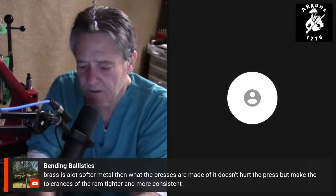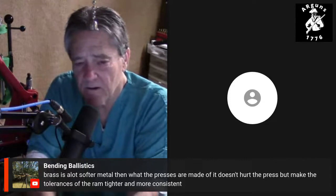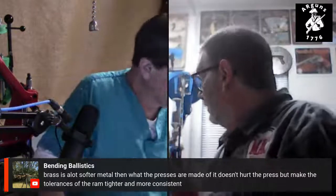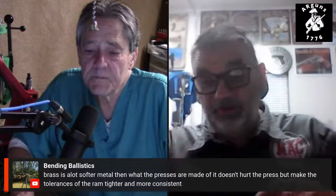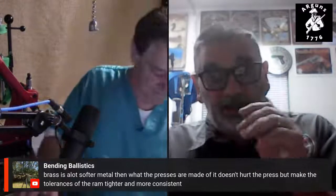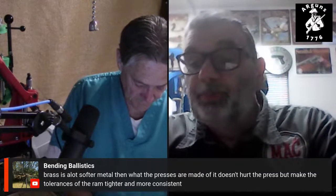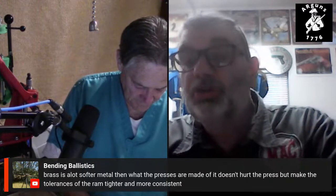What did you do, did just using the press smooth it out, or did you oil it or lube up the contacts on it? I lubed up all the actual shaft down the middle that turns the head. So I lubricated all that. And then I lubricated all the joints all the way down where you pull on the arm. And I put some oil and a little bit of light grease where the turret head turns and the detent ball and everything is. But I think the more I've used it, it has sort of loosened up a little bit. It's not quite so notchy.